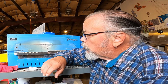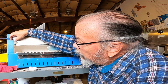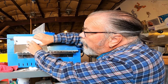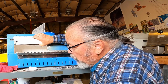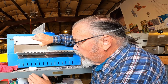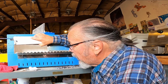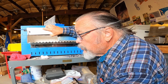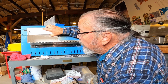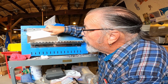What I'm going to do is repair this kiln door. There's insulation right here, and it broke. We're looking to see if we can find another piece that is exactly the same, but in the meantime I'm going to try to glue this together with some furnace cement. It's not exactly what I'd prefer to use, but it's what I have. The reason why I wanted the temperature to be up in here is because I want to make sure that that refractory cement, furnace cement, cures correctly. So I'll get started. I'm going to go ahead and take this piece off here so I can glue all these pieces back together.